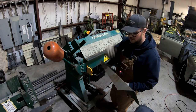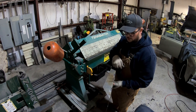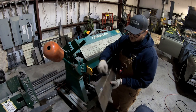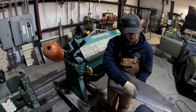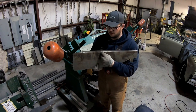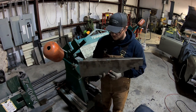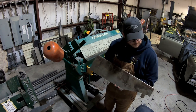That will let us put the hammer form down in there. I have some wooden dowels that are hardwood — I torch the end of them just to make them a little harder — and I'll use those as a hammer form to beat those conical beads down in there. Then this edge will come underneath the panel into here and I'll be able to clean off the excess. There'll be a little half circle in here and I'll grind that out or cut it out. Hopefully it'll look pretty close to the original.